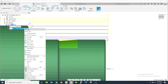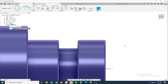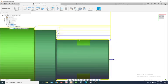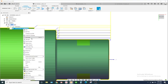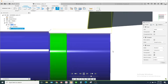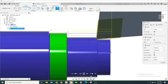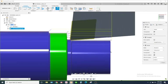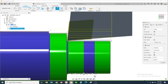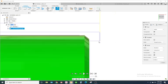So let's change that. So I'm gonna go to edit. And on my passes tab right here, it says grooving. I have it on allow radial grooving. I'm going to put it on don't allow radial grooving. So when I hit OK, it now cuts straight across. It ignores that groove. If I simulate it, okay, looks good.